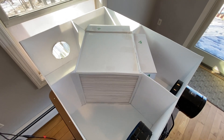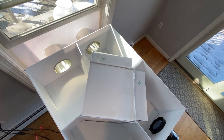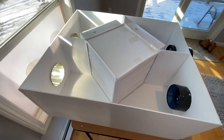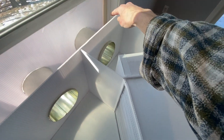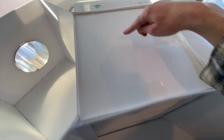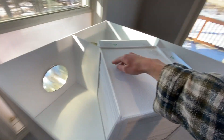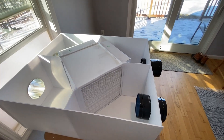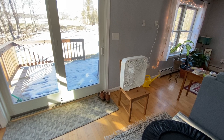The core is 14 by 14 by 14 inches, which is large compared to the others I've seen. The core's size allows the airstreams to slow down enough to be properly warmed, and it's winter right now so that's important. Fresh air comes in this 6-inch duct and passes through these channels in the core, and stale air comes through this fan and passes through these channels in the core, transferring its heat to the fresh air. Of course the streams don't mix, which is pretty cool. A series of fans blows the air to other parts of the house — for instance, this box fan blows it to the kitchen.